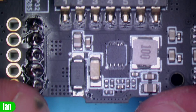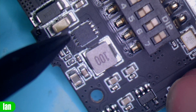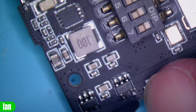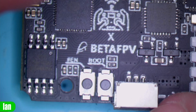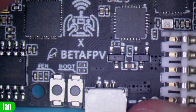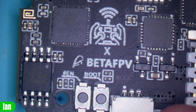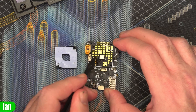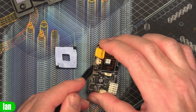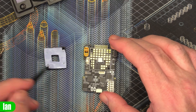Flipping the board over to the other side, we have a BEC — identifiable by a coil, a diode, what is most likely a voltage regulator, and some additional transistors. There's also a small copper swirl on the back side of one of the PCB antennas. The overall build quality looks very good — the soldering and components look absolutely fine, just like the other board. I've also quickly removed the heatsink to show the setup underneath: there are little copper squares that help transfer heat from the Express LRS module through the PCB, onto the heat pad, and then out through the heatsink with active fan cooling.